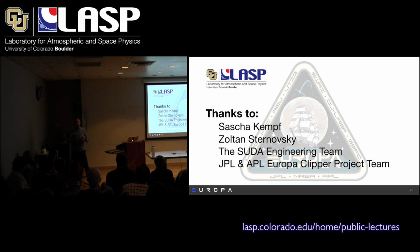So that plasma is moving by. Europa's, I think it's something like 14 kilometers per second orbital speed. That plasma is moving at 100 to 190 kilometers per second. It's overtaking Europa. And so that movement of that charge is inducing a field, and that induced field is what we see as the spacecraft flies by. Galileo did it. Europa Clipper is going to have better magnetometers, and it's going to be flying by at a lower altitude.